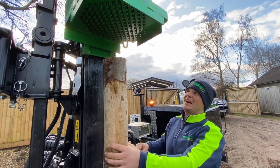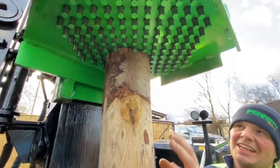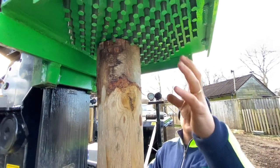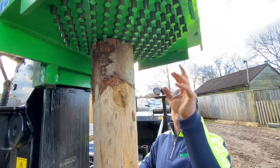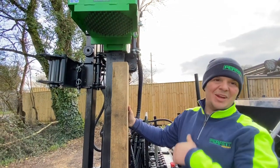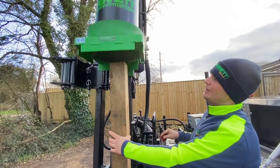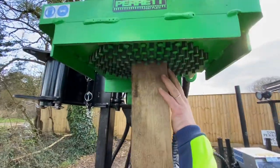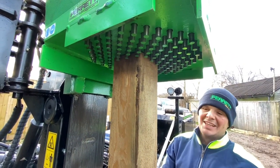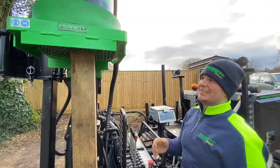After a lot of modifications, we're now up to these different patterns of perfectly weighted pins. It's pretty much knock-and-drop: we bring the knocker down onto the plate and you'll see that instantly the pins retract underneath it while the others hold firm around the sides. This stops the chestnut wanting to split out, supporting it while you're knocking. You can put that piece of timber anywhere you want under here — we knock a lot of our timber out to the side so we can look down through the line with really good vision. It works with 5x3s, 4x4s, 3x3s, 6x5s — whatever you want to put under here — and the pins all around the timber really help stop the post wanting to twist as we knock in.